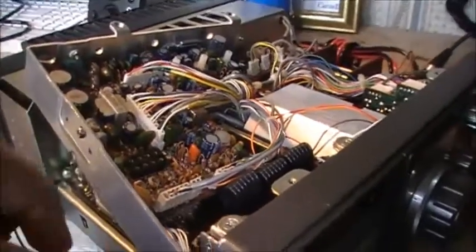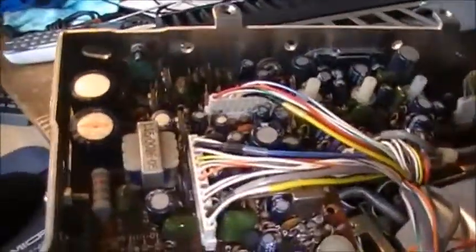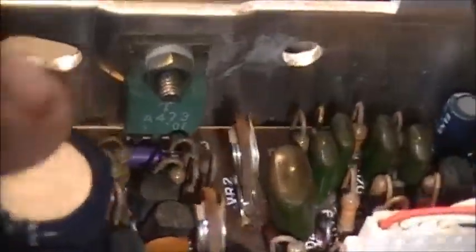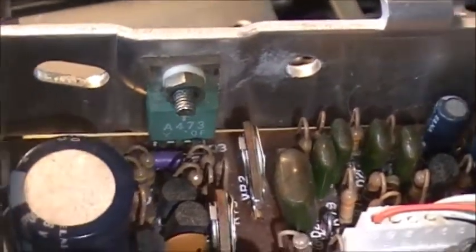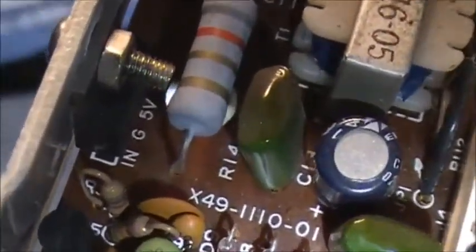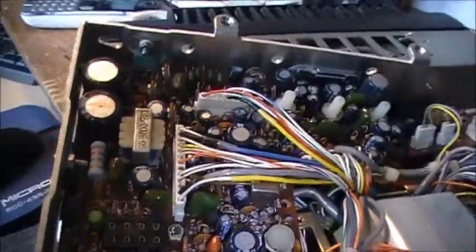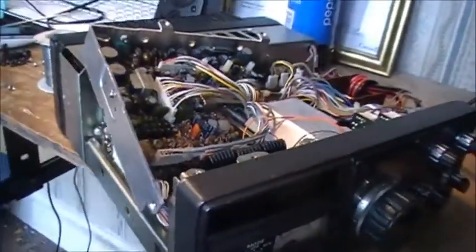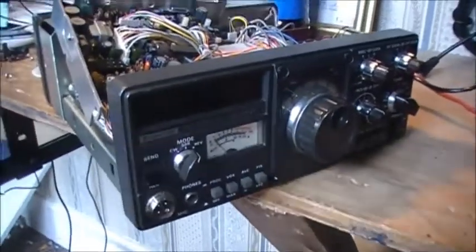I got the board put back in — just had it all out and re-soldered. So basically what I've done: I re-soldered the pins going to Q3, added a little extra connection to the rest of the traces. As well as Q2, the 5-volt regulator — the circuit board was actually damaged next to that, so I re-flowed the solder on that regulator and beefed up the solder connection. Now let's turn on the radio and see what happens.